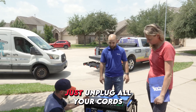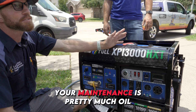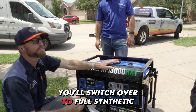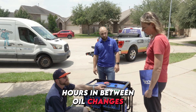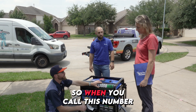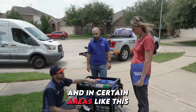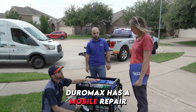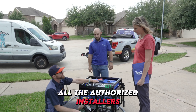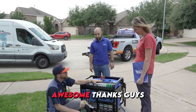Now that you're done, just unplug all your cords, roll them up, make sure your battery is turned off, and store it in your garage. Maintenance is pretty much oil changes — check your owner's manual, but after eight hours you'll switch over to full synthetic oil and then you can go 100 hours between oil changes. You have a five-year warranty on this generator. Duramax has fantastic US-based customer support — when you call the number written right here, you get a human in America who wants to help you. In certain areas like this one, Duramax has mobile repair technicians who will come to your house for warranty repairs. All authorized Duramax installers will also find a way to help you out if you're in a bind. That's kind of the difference with Duramax.